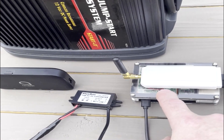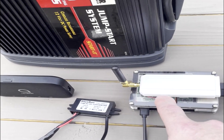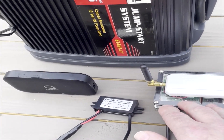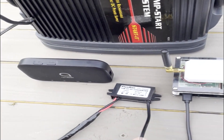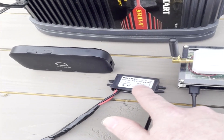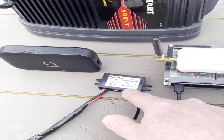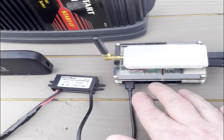This part here is very useful. The Raspberry Pi takes five volts — the 3B needs 2.5 amps and the Raspberry Pi 4 needs 3 amps, but both are still 5 volts. That's kind of hard to find in a vehicle, so this device takes the 12 volts from your car and steps it down to 5 volts going into the Pi. These are anywhere from five to twenty-five dollars on Amazon.